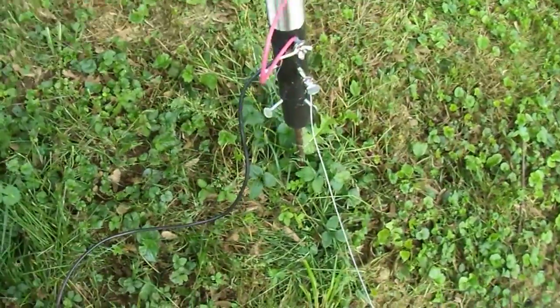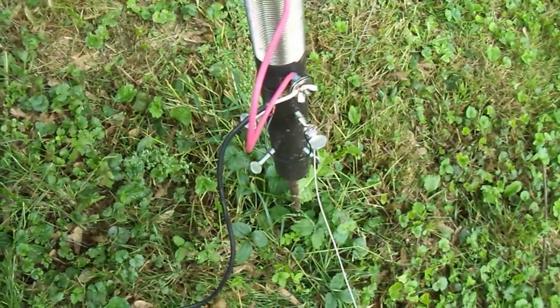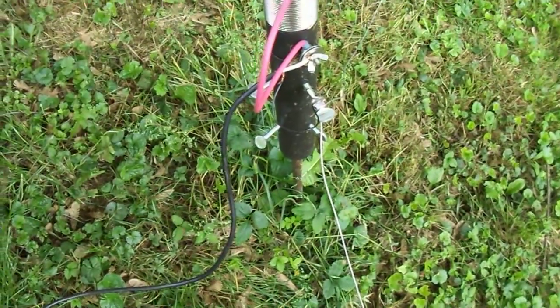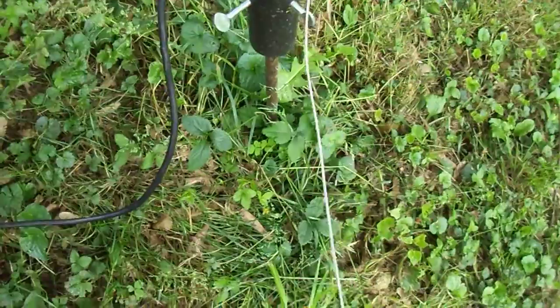Overall, I like the antenna. I think it's pretty easy to use and pretty mobile. I've taken it to work with me — I use a piece of conduit up there as a ground rod. But the one thing that really helps on this is a good ground and radial.